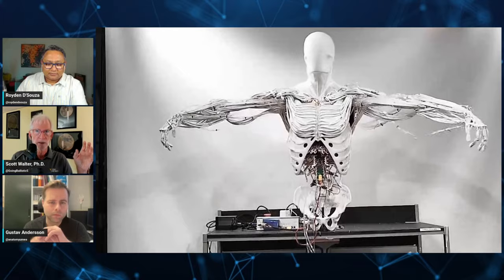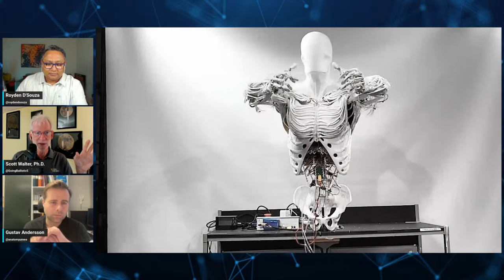They have to come up with a completely different strategy which emulates the movement of a human shoulder but doesn't precisely do it. When you finally get one of these bots — from 1X, Optimus, or Figure — and you start playing catch with them and want them to throw a ball, the way the shoulder is articulated probably won't be exactly the same as how we do it. Our shoulder doesn't have motors at right angles — it has muscle groups that are not necessarily orthogonal, so in certain movements the torques applied are very different. You get a very different kind of motion than what you'd expect.